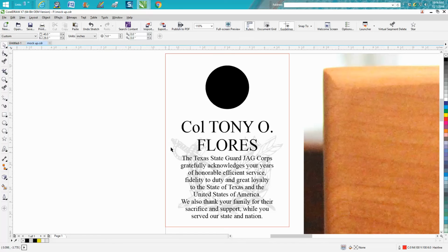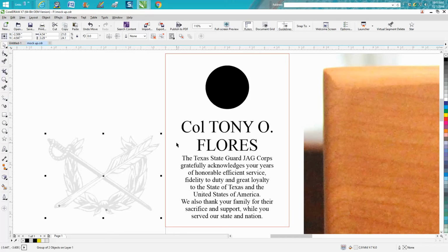But the way I ran it, I made the block. I ran my hairline to make sure my plaque was in the right position and everything in the laser. But then I took away my watermark off the page. I had my nudge factor set on 5 inches, and I ran this at 60 speed, 100 power. And then I selected this one, and I ran it a couple more times to give me some really good depth for the coin to set into.